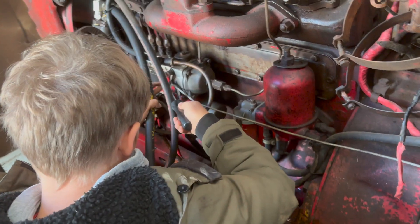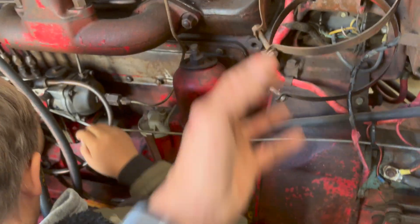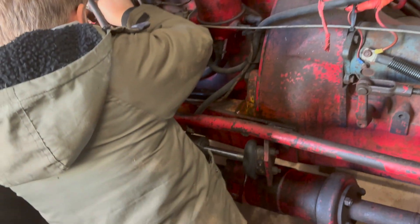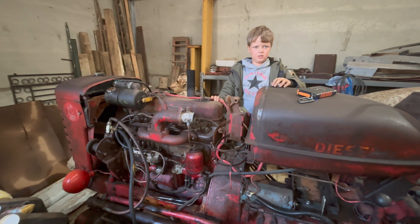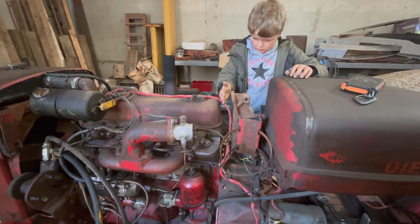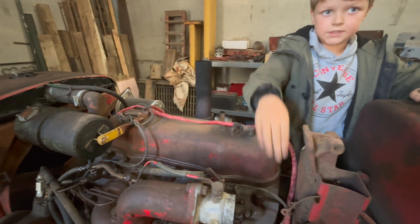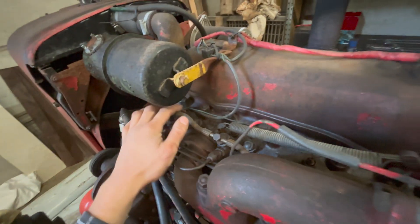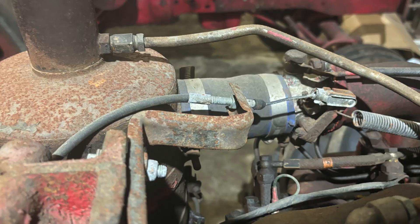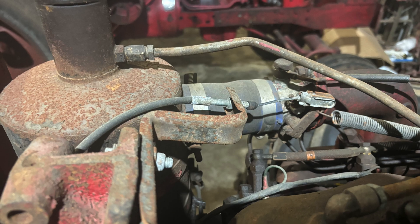Charlie's just undoing the stopper. I've already got the throttle undone. I'm taking the air filter off and just draining it of diesel as well. Just to show where we're splitting it — we're splitting it here. What you need to remove now is the wires for the lights and the dynamo going into the front, and then you've just got to disconnect all these glow plugs. Also need to disconnect the oil breather to air filter, the air filter pipe, and throttle linkage cable.